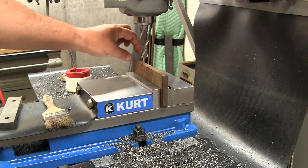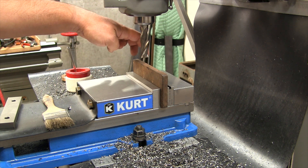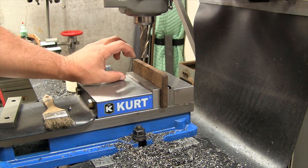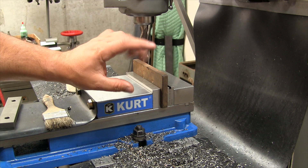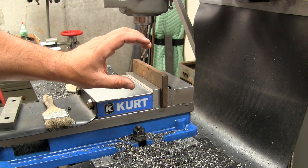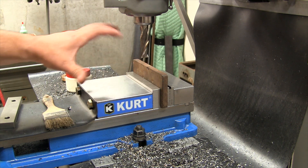Basically what we are going to do is get another little piece of metal, drill and tap it, and be able to cinch it down. I am going to make the circle — it's a circle and it has a flat. I'm going to make the circle and the flat stick a tiny bit proud, just so I have a lot of good bite to squeeze down on this.